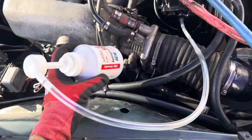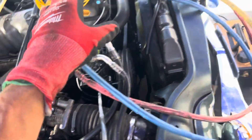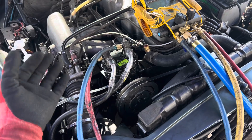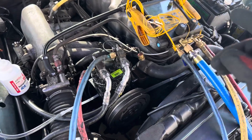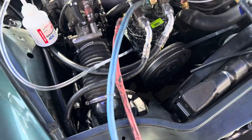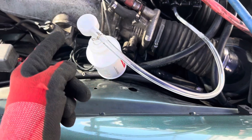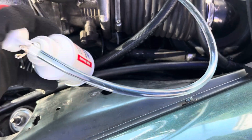This had an aluminum seal on it. Even though I hate PAG or POE oil in plastic, I have positive pressure going. I left this under vacuum - got it down to one or two hundred microns of vacuum and left it on overnight to check for leaks. You should not leave a vacuum overnight if there are leaks because you'll just pull in all the moisture. But I didn't have a leak, so I hooked up and put it under positive pressure. I now have a really slow nitrogen purge going into this thing - nitrogen is coming out of the oil fill plug over there, pushing out, and now I'm going to fill it up.